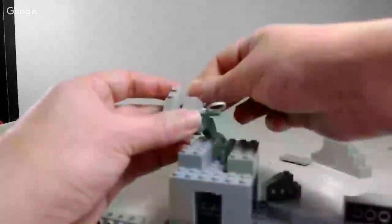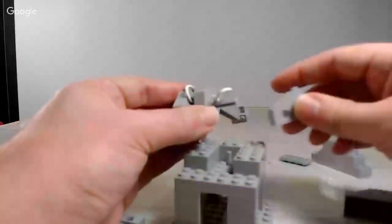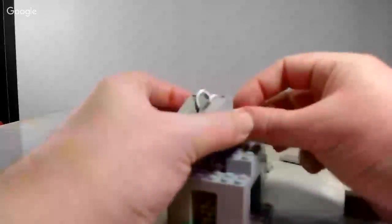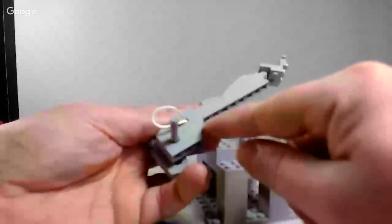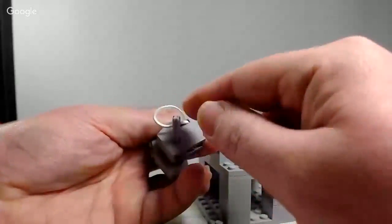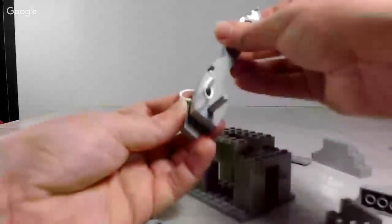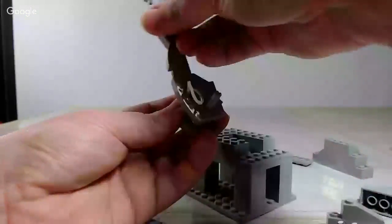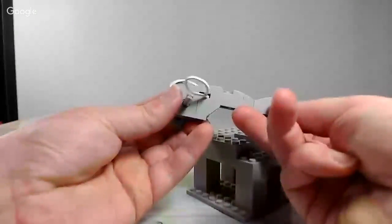And we want our elastics to go over top of where our pivot point is going to be. And that's really important, because if we had our pivot point behind where our axle is, or in front of where our axle is, we wouldn't get as much strength. If we put it behind, it's going to loop over that pivot point and it's going to want to pull the arm forward even further. If you can mount that elastic even further back, you even get more force. Okay.